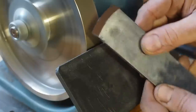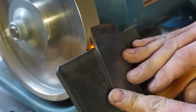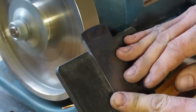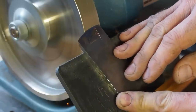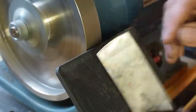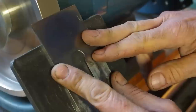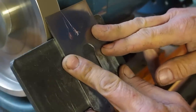But high-carbon steel, I haven't found it to load the tool up at all. It may void your manufacturer warranty, but I found good luck with just my high-carbon steel. Maybe it's because modern steels, as they're made, are generally pretty hard. You can see I'm getting a decent grind on it. I like it because you don't have to flatten this wheel, and it runs cool. And it also doesn't kick up that aluminum oxide dust that comes off of a standard grinding wheel.